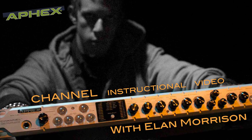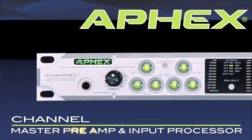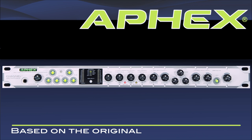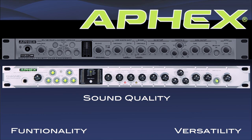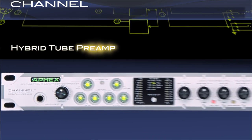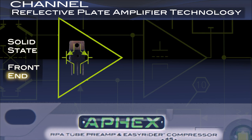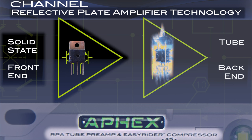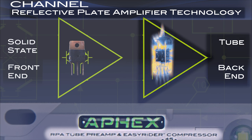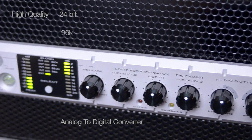Today I'd like to introduce you to all the features of the Channel. This is a brand new product from Aphex for 2011. The legendary model 230 has been reimagined, adding a host of new features while retaining its sound quality, functionality, and versatility that made the original 230 a classic. Channel is a hybrid tube preamp using Aphex's patented Reflective Plate Amplifier technology. It has a solid-state front end which gives it a very fast transient response and a very detailed sound, but it also has a tube back end that gives it a nice round warm sound. Think of it as a Neve-style front end with a Universal Audio-style back end. Channel also contains a ton of Aphex processing as well as a high-quality 24-bit 96k analog-to-digital converter.